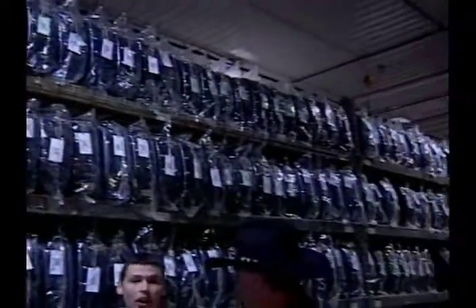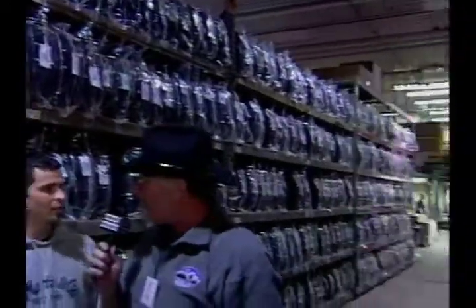Chris, we're in guitar row. Yes, we are — these are our finished products. These are all the Martin guitars that have been strung up and inspected, and they're waiting eight days before they're re-inspected to make sure everything's just right before we send them to the customer. Every guitar comes out of the case and gets replayed again — re-tuned, and if the neck needs adjustment, which could be the case since it's the very first time it's had string tension, that will all be done. It may take just a few minutes, or up to 15 minutes if we need to adjust the neck or possibly replace the saddle.